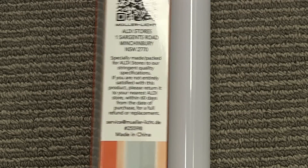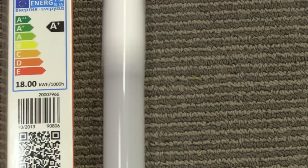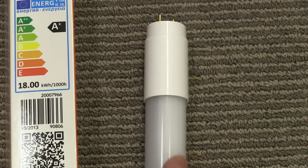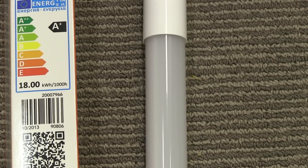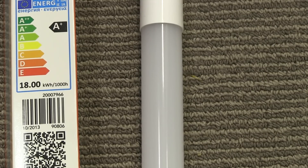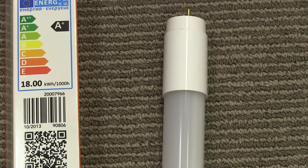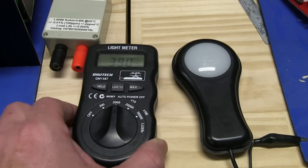The tubes are completely frosted — a lot of these LED tubes are clear but you can see extra frosting on this one. I can't see any of the LEDs or PCB through there at all. You have to install these the right way up of course, otherwise the light bounces up off the reflectors in the trough rather than downward. I've got my light meter positioned pretty much directly under my dual strip fluoros.